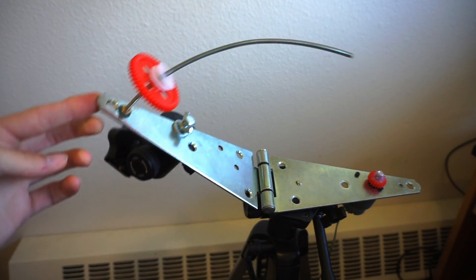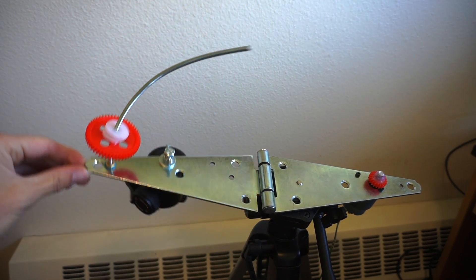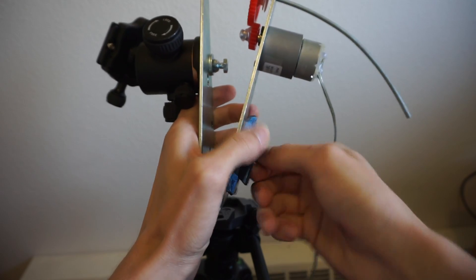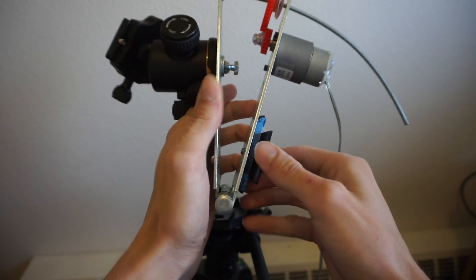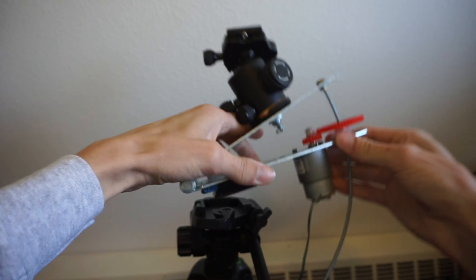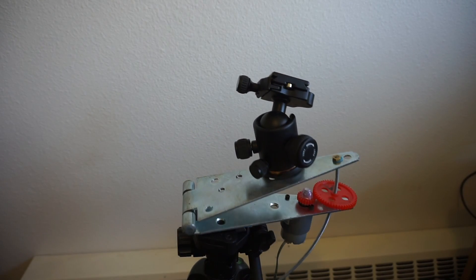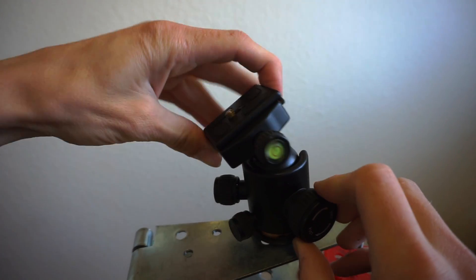You start with a large hinge that you can just go buy at the hardware store — try to find one that doesn't rattle too much. You add a quarter-twenty tapped hole at the bottom to accept a tripod thread; the threading in the bottom of every camera and tripod is standardly quarter-twenty. You add an off-the-shelf ball joint to the top for aiming the camera, and then of course the actual motor and lead screw assembly that slowly pushes the hinge open, tilting the camera.